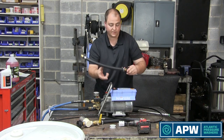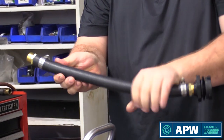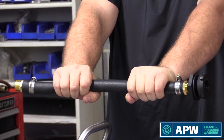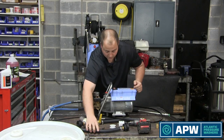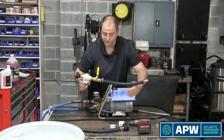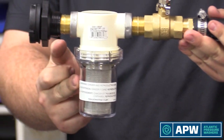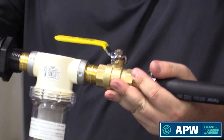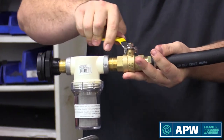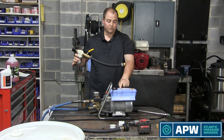The next setup is again the same bulkhead fitting, but this time you're hard-plumbing an actual piece of non-collapsing hose — non-collapsing meaning I can't crush it — going straight to the inlet of your pressure washer. Then the third, more complicated, a little bit more professional setup: you've got your bulkhead fitting, a see-through filter so you can actually see what kind of debris is coming out of your tank, and most importantly a ball valve so that you can disconnect without draining your tank. This just turns it on and off, and again hard-plumb non-collapsing hose straight to the washer itself.